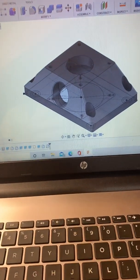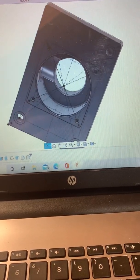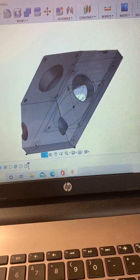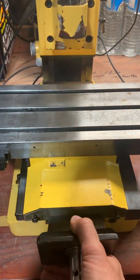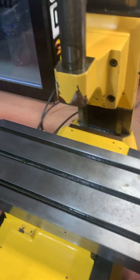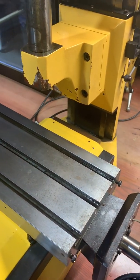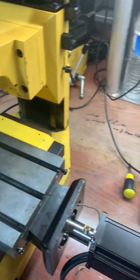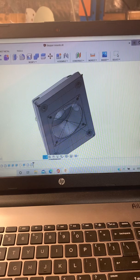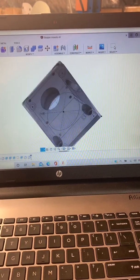Quickly running through the mount: it's fairly simple and basic. I was going to make it out of cast iron but decided on aluminium to avoid putting excessive weight right out here, which could influence the ways. The machine's in pretty good condition. I might pull it down and scrape it once it's running, but for now I don't want excessive weight hanging out with a big bending moment. I've pocketed it out as thin and light as I can, so I'll leave it at that.